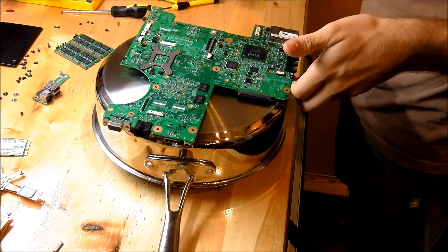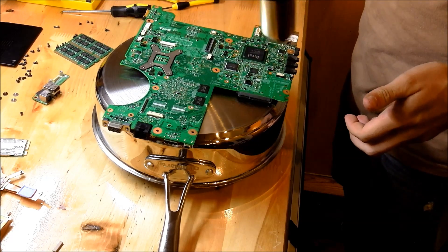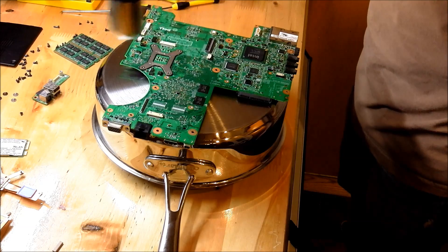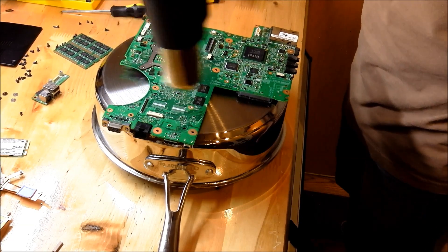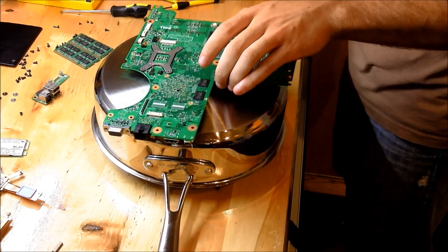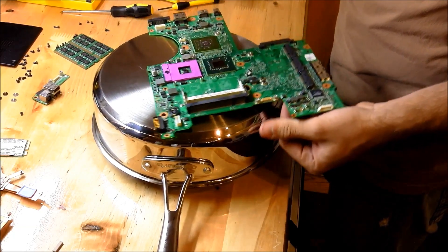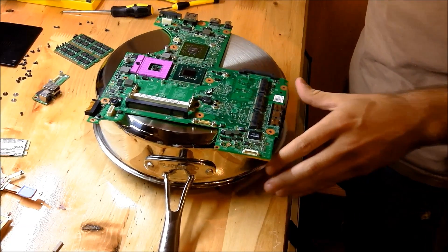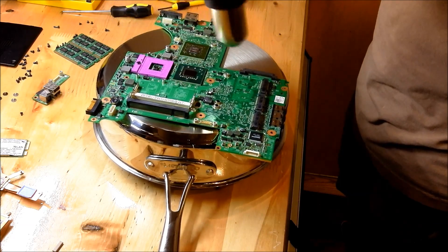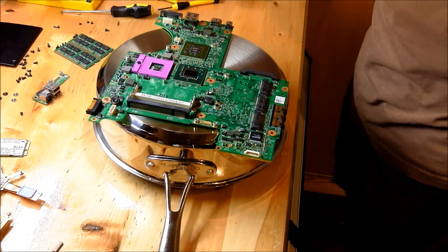Be careful on the underside. If you get the underside too hot, what's going to happen is you're going to hear a couple of little clanks hit the pan - that means you've desoldered the capacitors from the motherboard. So just kind of get it warm. You've got to be really careful when handling this. It's actually a bad idea to do it with one hand, because when you move the board, that increases the chances of introducing more problems.